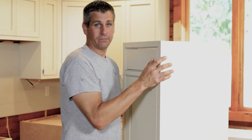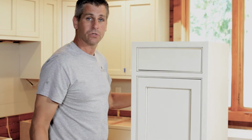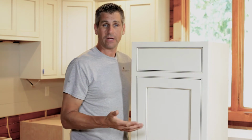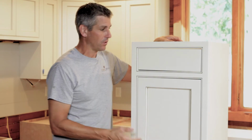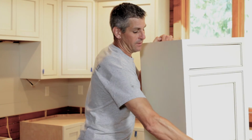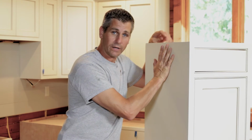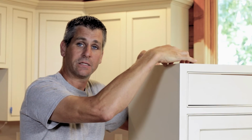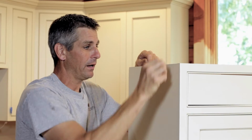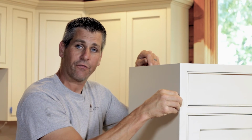On flush end, I'm going to spin this around, the difference on flush end, and this is what we're going to use automatically if you're ordering the Advantage full plywood box and you say I want a finished end, we're going to default to this. Same thing, you're getting a matching veneer finished in crystal white coffee glaze or whatever your finish is, but what they've done is they're using 11/16 thick plywood which pushes out and then more or less fills in that void behind the front frame. So now instead of 5/16 of an inch, I'm getting just about a fingernail.